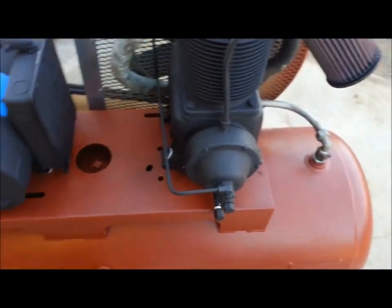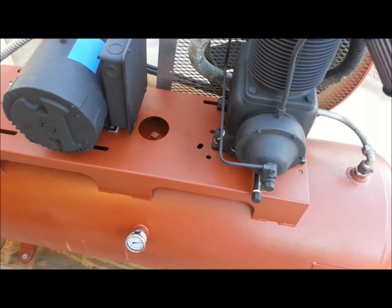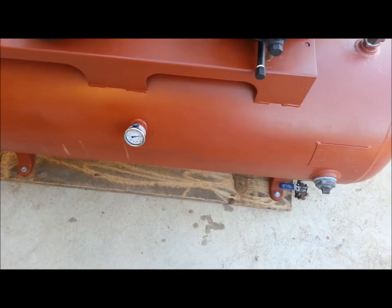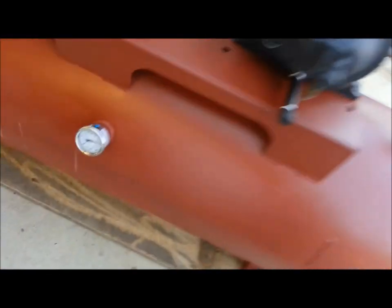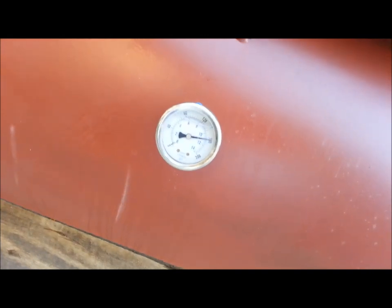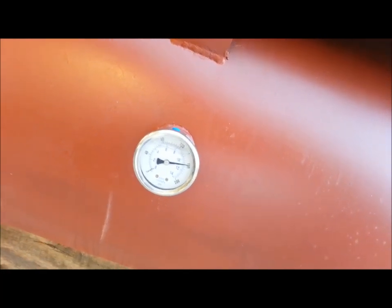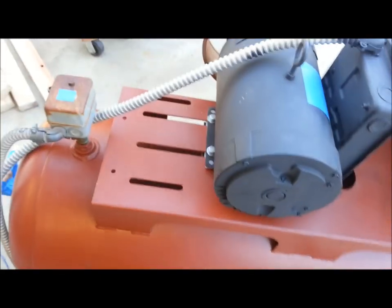This thing is pretty bouncy - it's a real thumper. You can actually feel it on just these wood slats; the concrete slab thumps a little when it's running. The check valve checked out good. We actually got tank pressure and it held overnight - it dropped a little, we soaped all the fittings, everything - but I'd attribute the pressure drop to the temperature change overnight.